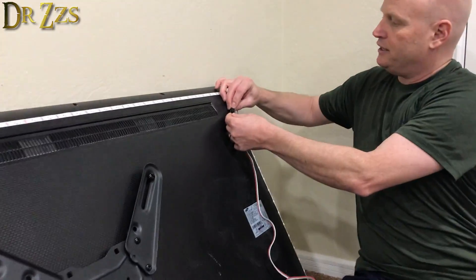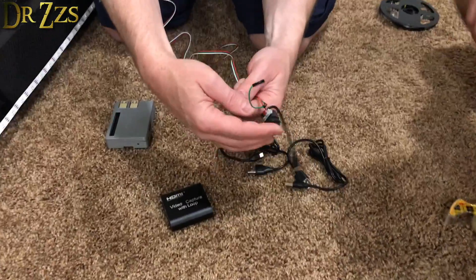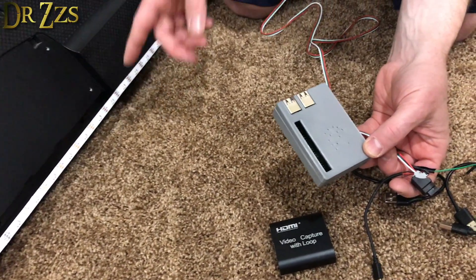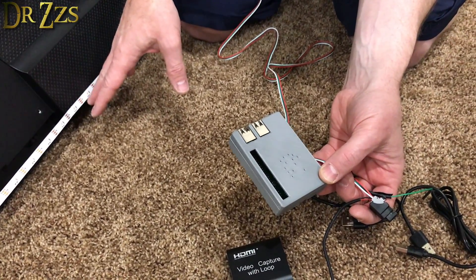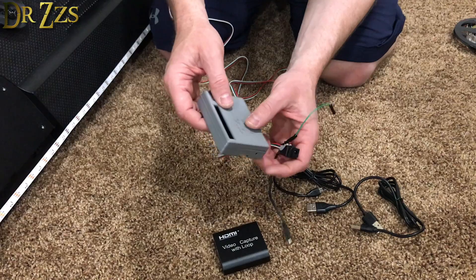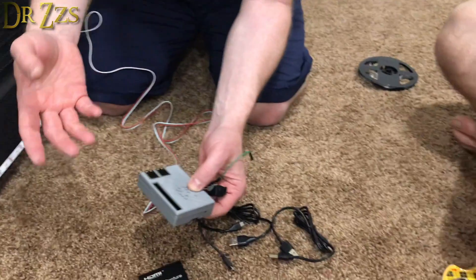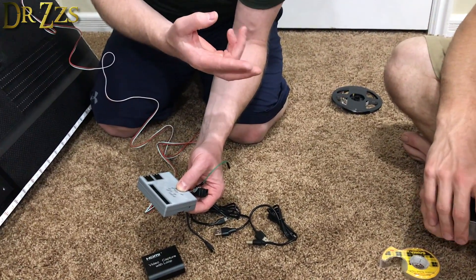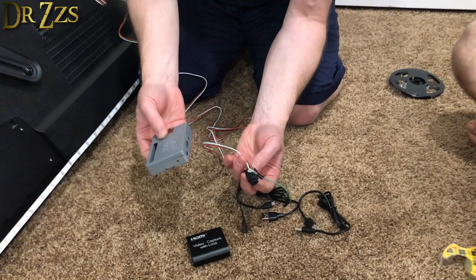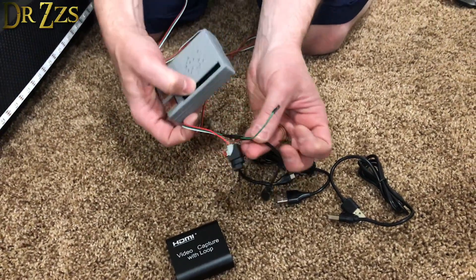This is genius right here. The issue is the Raspberry Pi takes two and a half amps, and with all these LEDs you're probably at at least four amps, so you need a six amp power supply or two different power supplies. Since you need to share a ground between the Pi and the LEDs — common ground — if you have two power supplies you can combine the grounds, but an electrical person would say that's a bad idea. Better to just use one power supply.